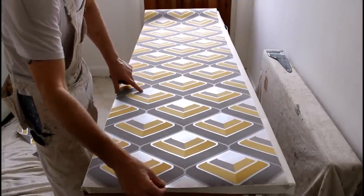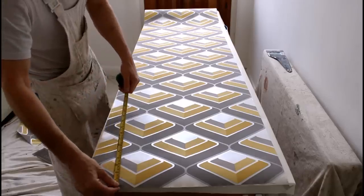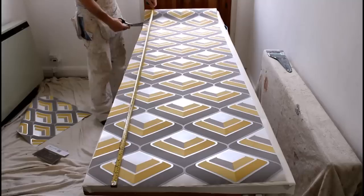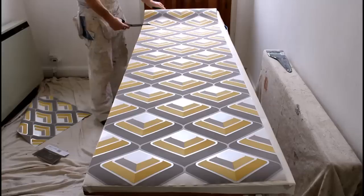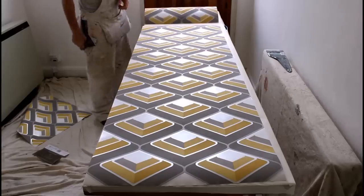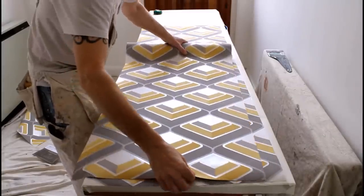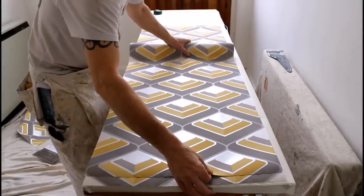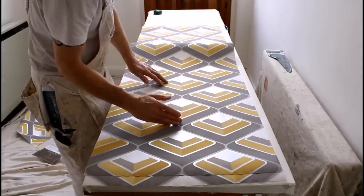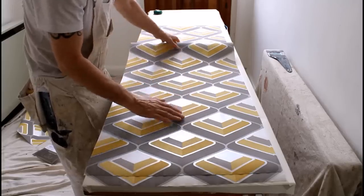You always got to make sure your paper's straight on the bench, because when you make your cut, if it's not straight, your paper's not going to be cut straight. So 5 foot mark. With it being a repeat pattern, it'd be easy enough. Now, depending sometimes where you cut it at the bottom, depends where it's going to line up at the top. And a repeat of 64 centimetres, you can have a lot of waste at times.